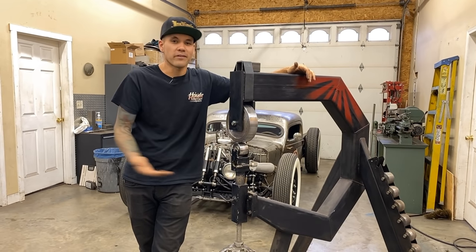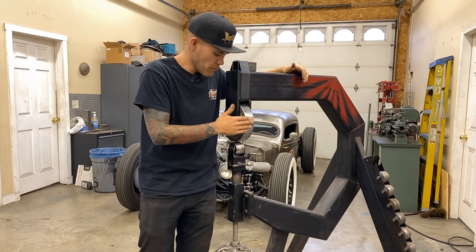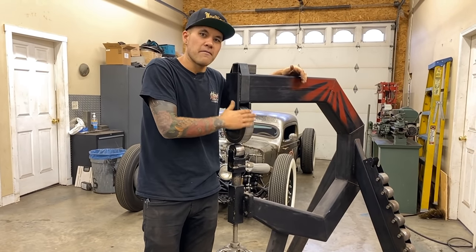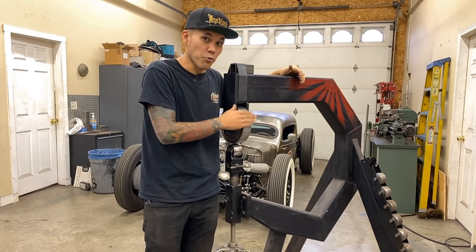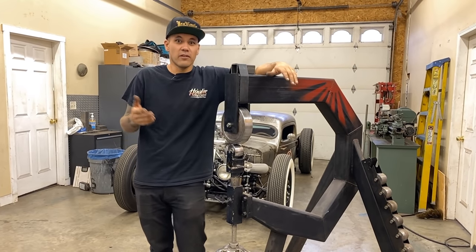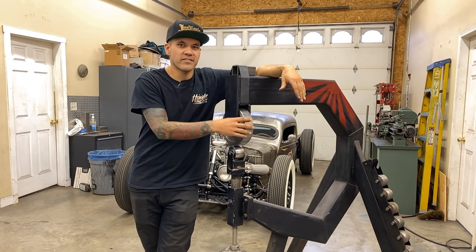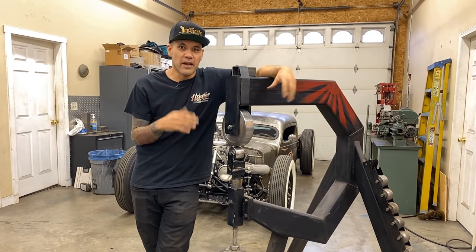So these ones, being a cheap English wheel, they're okay. I use them and they're fine. They're not beautifully polished. They weren't finished with an extremely chrome-looking polish. That is something that you'll see on a lot of really high quality wheels. They'll have super shiny dies, and that's for surface transfer and consistency.